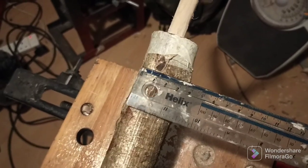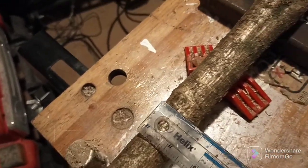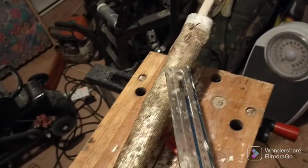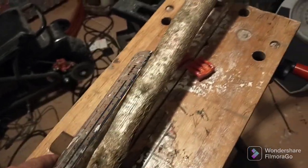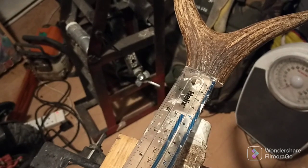I've got to burn that artwork onto this particular stick, and that's before I do the stencil at the top with all the fancy inlay stencil work on it. It's going to be painted, which means I've got no option but to varnish this stick. The diameter — I'll quickly show you with a ruler — at the neck it's about four centimetres in diameter and it's of an oval shape. When you come down where it starts to get more of a cylindrical shape it's about three centimetres. So I've got to get this more uniform — I'm going to have to plane from there down with the block plane to gain more of a cylindrical shape, though the top piece will have to stay oval to marry up with the deer antler.